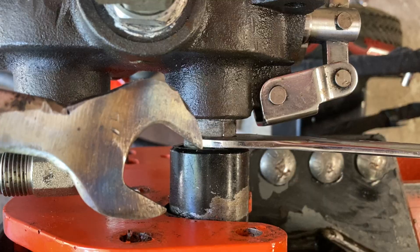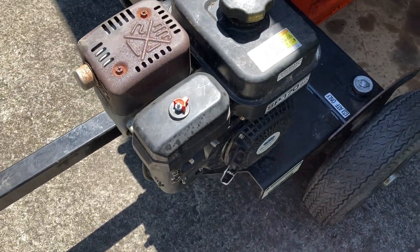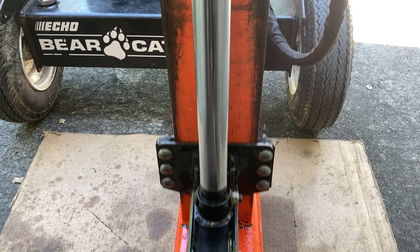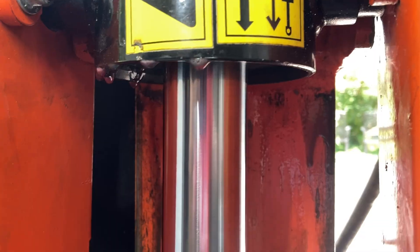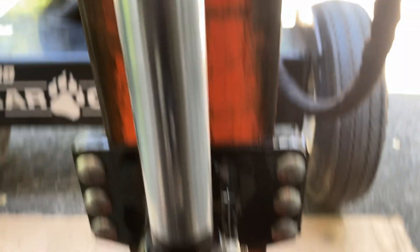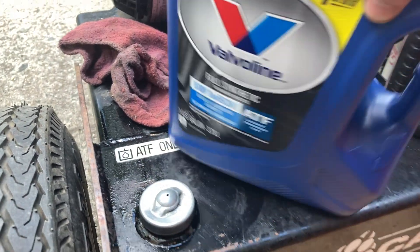Let's get this valve back on the cylinder. Well, there's no leaks — but then there wouldn't be, because if you couldn't tell by the way the ram is moving, the pump is sucking air, not fluid. It still hasn't primed, but it has started leaking. See how frothy it is? Those are bubbles from cavitation — it means it needs fluid. $40 of brand new fluid later, and it's barely at the low mark on the dipstick. Don't be an idiot like me — always use a clean drain pan so you can reuse it.